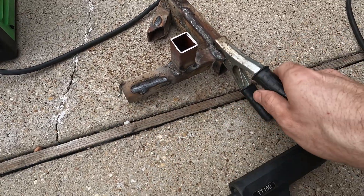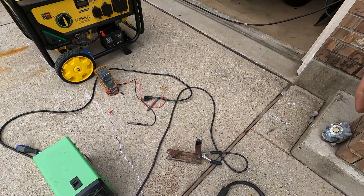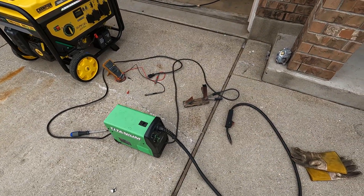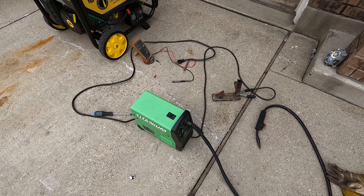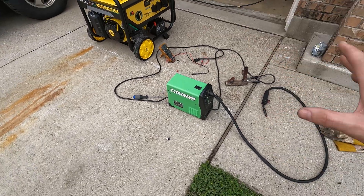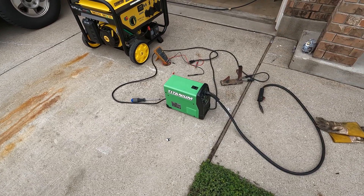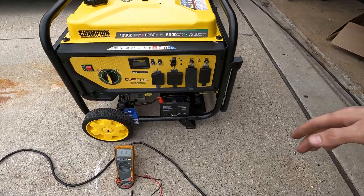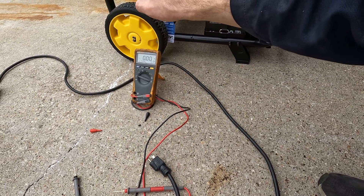So there it was at full power, and there was half power. I didn't clean any of it off, but the penetration felt fine. It felt just as hot as it would be if I plugged it into the wall, and I've used this welder a lot. Using this setup there was no compromise — I didn't feel like the welder was losing power and it didn't sound like the generator was really struggling. I did check the frequency while welding and it dipped down to about 58–59 hertz for about one second, but then the engine quickly recovered.